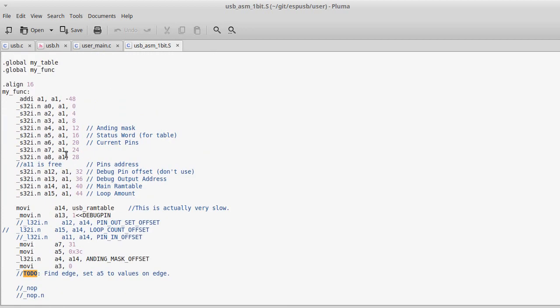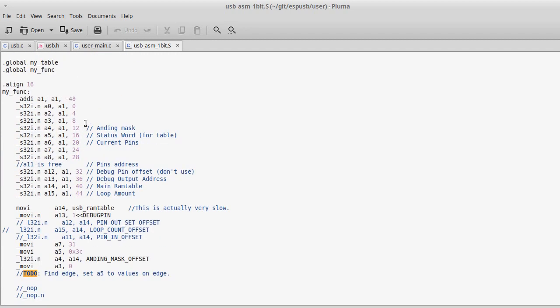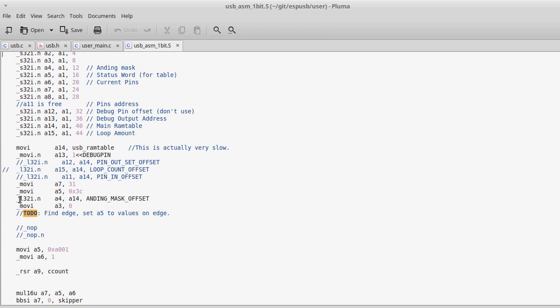At any rate, I wrote my functions and started learning how the stack works and how you push and pop things. There are some really annoying things about Xtensa. Like there's no instruction that will move a 32-bit value into a register. Instead, it has to move it from a relative place in Flash into the register, which is annoying because then you have to have a pointer to the things. Thankfully, GCC handles that, so it can just do this here.